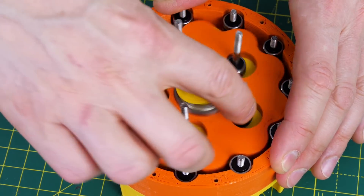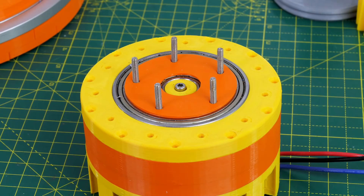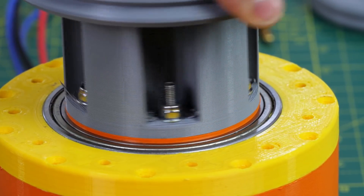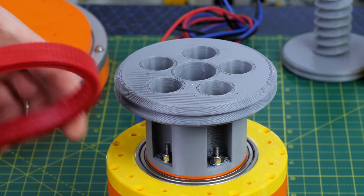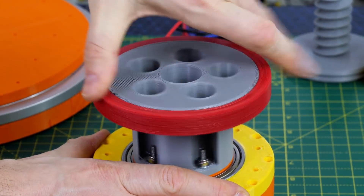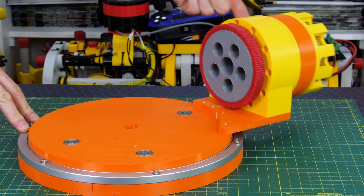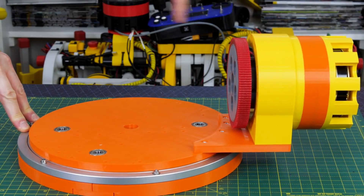I'm using the existing cycloidal drive reducer - my second prototype - to run this, and that's the one that was previously running the previous CVT. I've got a thing that bolts on the top here and that's going to be the main output, bolted onto the bolts that run all the way through the cycloidal drive. I've printed a TPU tire for it as we had before - this one's got teeth on though rather than being smooth so that should just stretch and fit onto that pulley. The motor's mounted on a bracket which has a hole in the side so I can just slip it in and screw it on, and that's mounted to another plate so the whole thing can be mounted on the turntable - the motor and the whole mechanism is going to rotate round with the base of the arm.